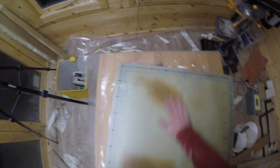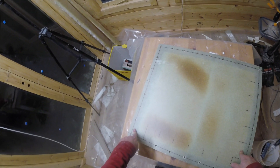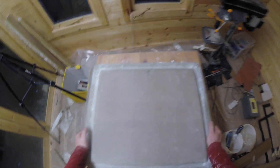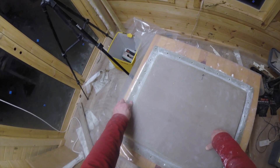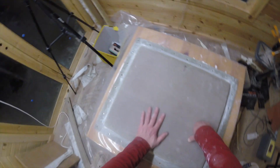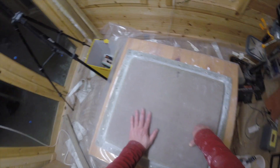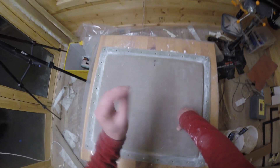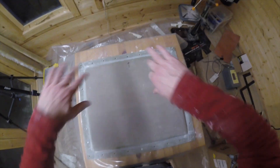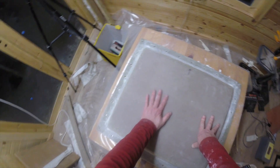It's not a problem — I'm going to paint this up in a minute. I drilled the holes around here; they're 9 millimeters for the M8 bolt. The only other thing that's a little disappointing is I laid this up using chopped strand mat, then put this foam core in, then more chopped strand mat. The last piece of cloth I put down is called S-cloth — they use it for making surfboards. It's a really fine material which I thought would just drape over beautifully and give it a nice smooth finish compared to the corrugated effect you get with chopped strand matting.